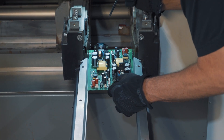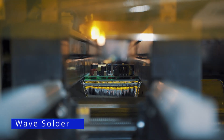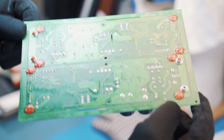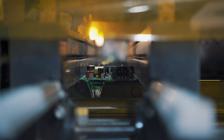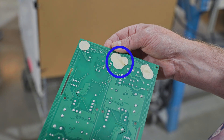Now let's look briefly at two alternatives to selective soldering. We can use wave solder for mixed technology boards that are mostly through-hole with a few simple SMT components. These are glued to the bottom side of the board and the solder wave contacts both the through-hole pins and the SMT leads. This works for simple SMT components only — it can't be used for BGAs, leadless packages, fine pitch, or heavy SMT components. And since the solder wave covers the entire board surface, manual labor may be needed to mask areas that have to be kept free of solder.